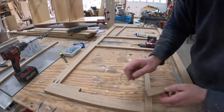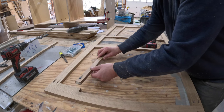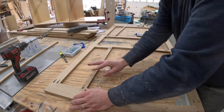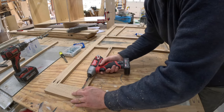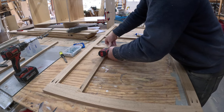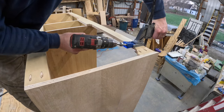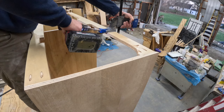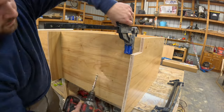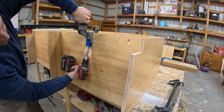When building out the drawer sections on the face frame, I cut two spacers exactly the same length to ensure that the spacing was dead perfect across the length of the drawer. This is super critical to get right — if not, the inset drawer spacing will be off and it's going to look crooked because your reveal around the edge of the drawer will not be consistent. Back over on the cabinet box I drilled pocket holes along the top, bottom, and end that goes up against the wall. These will be hidden in the final product but provide plenty of strength to attach the face frame to the cabinet box.